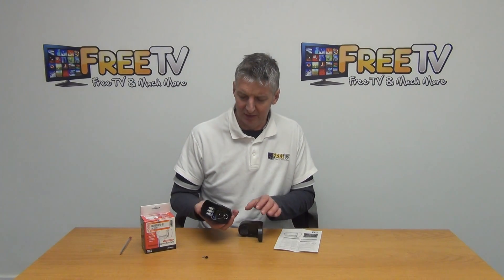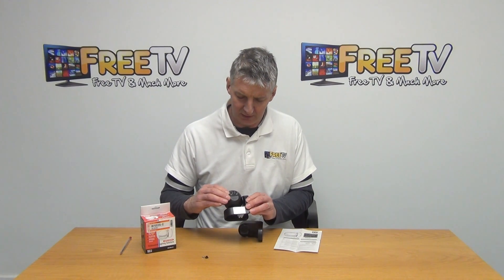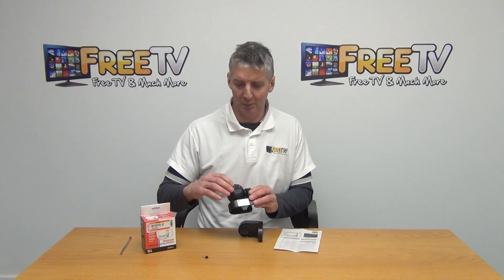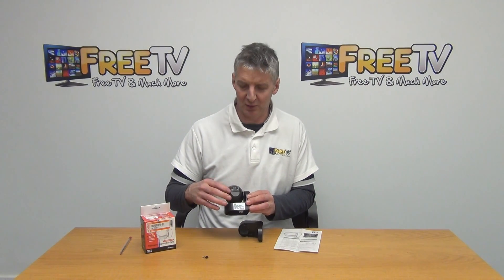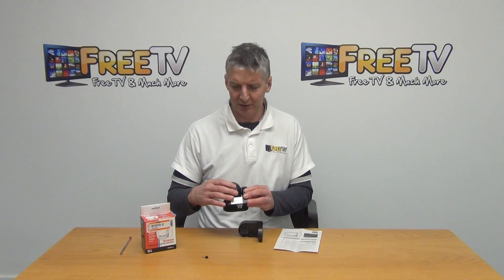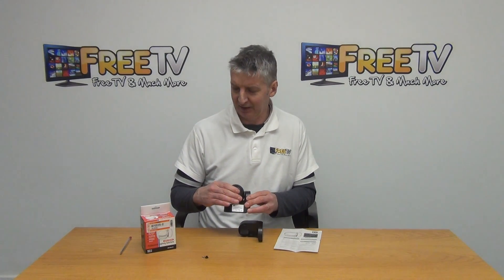In relation to the adjustability, there are two sensors apart from adjusting the angle. The first one allows us to adjust the duration — from a minimum to a maximum — so we can set the timing on it. We can also adjust the lux setting, so we can specify whether we want it to work in dark, semi-dark, or shaded conditions — essentially deciding when we want it to kick into action.